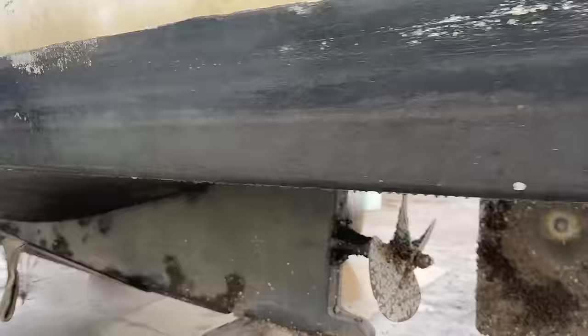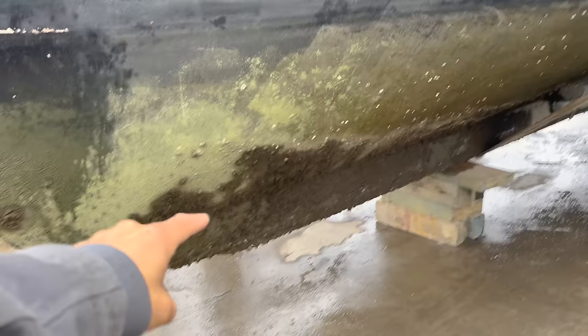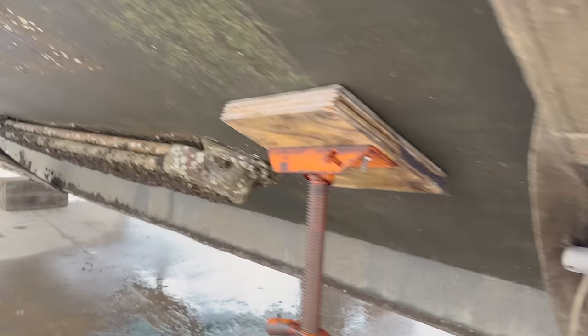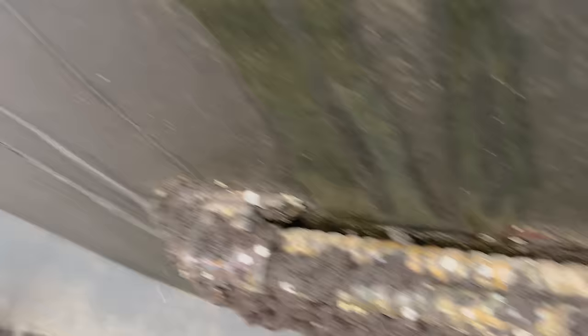She's missing a little paint on the stern, which is not that big a deal — that was from breaking up some ice. But the rest of the bottom is in immaculate shape for not being hauled out. It's got a little stuff in the bow because that gets more sunlight and tends to grow algae, but it's in good shape. All the transducers are well and intact. The keel cooler definitely needs cleaned off, but it was running at temperature and looks better than the bottom of the Southern Girl. I'd like to find out what kind of bottom paint they used.